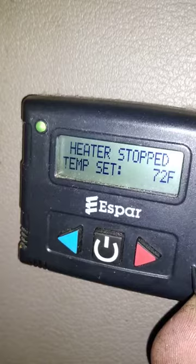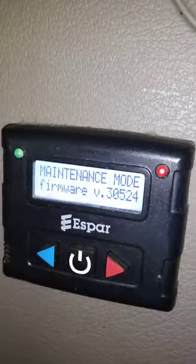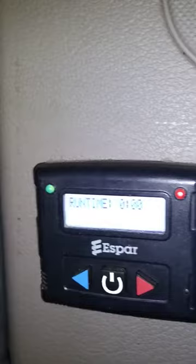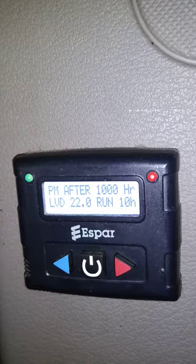Push in and you'll see the screen go blank. Take it out and hold the power button down — you will be in maintenance mode. This is after the error code 'maintenance required.' It's usually a runtime reset. It's going to do your memory tests and diagnostic tests. You don't need the diagnostics, so hit no. The runtime will stay where it's at — let that go through. It's set for a thousand hours.